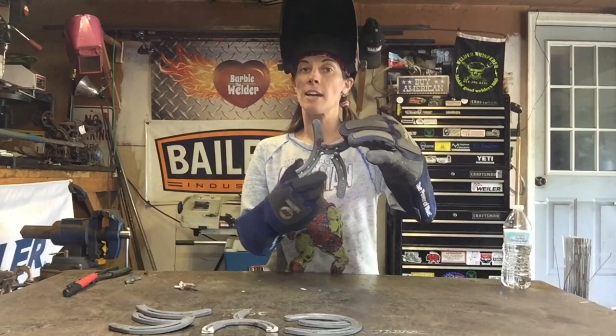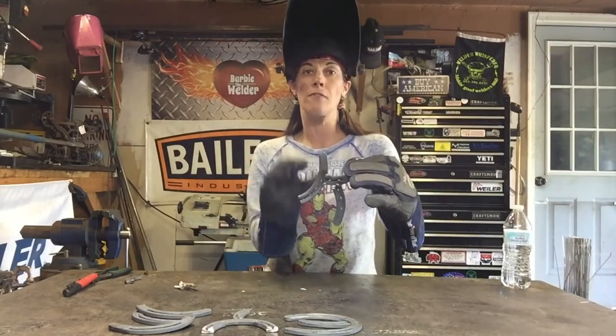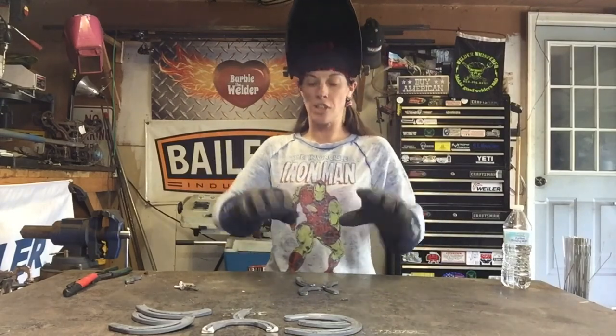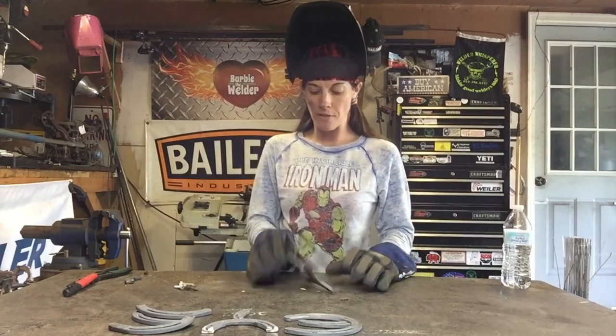You take your time, you pulse your trigger a little bit, and you can slowly fill that in. So MIG welding is awesome. There's a lot of leeway you have in there. Once you get it tacked up, just keep an eye on that and watch the shape of it. Mine's starting, you can hear it, to come off the bench a little bit.